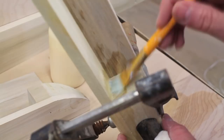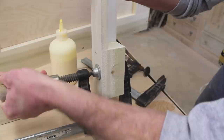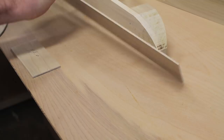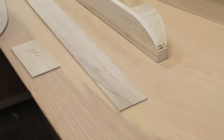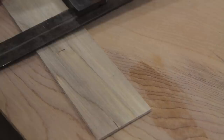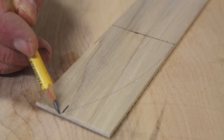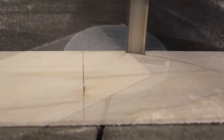This is a leg I glued up earlier this morning — I'll unclamp it and we'll cut the pattern into the bottom of the leg. I'm going to make the pattern, which is the curve in the bottom of the leg. I'm using the cutoff left over from when I milled the legs, measuring up three and three-quarters from the bottom of the leg and thirteen-sixteenths right at the bottom. I'll square across at the three-and-three-quarters mark and draw a simple arc connecting the two lines. I've cut the pattern out on the bandsaw and now I can use the same pattern for all four legs.